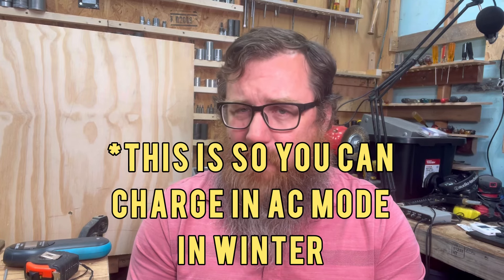Knowing that, it's easier in my opinion to try to get close in the wintertime — not try to perfectly charge anything — using whatever method you want, and then fine-tune it when it warms up. You can cause the machine to believe it's summertime by blocking the coil and artificially making the pressure higher outside. But depending on how you block that coil, it's kind of iffy. You can have the unit at full CFM in the summer and compare with actual measurable conditions.